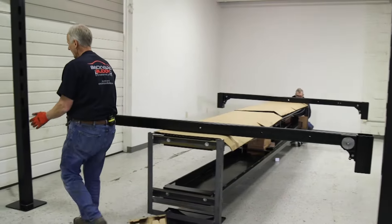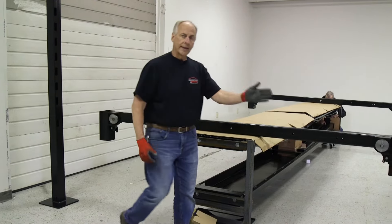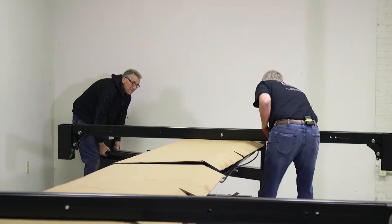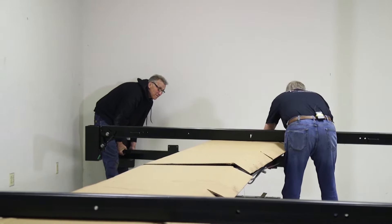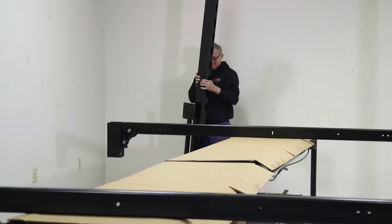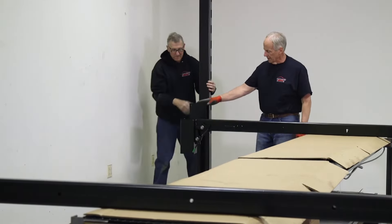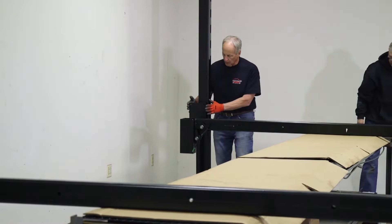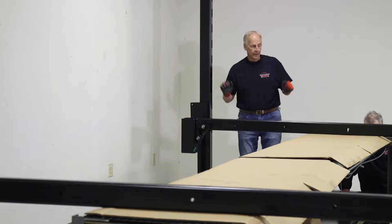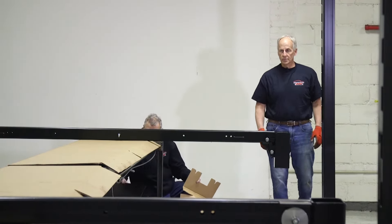When I come over to the other side of the lift it's a left-hand post, so now it's on the outer part of the lift. When we put our cross arms on, the locks will engage into these slots. Now we're down to the post that has our power unit bracket on it — you can tell because it has the bracket at the very bottom of the lift. You'll notice an extra part welded to this post on the base plate for attaching the power unit. Again, my locks are on the outside of the lift — important to get that set up correctly.